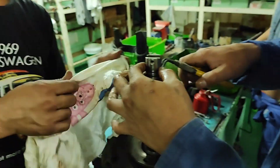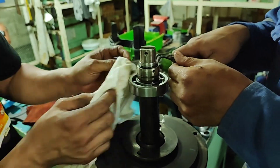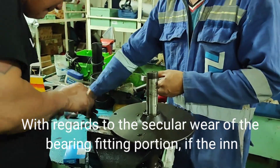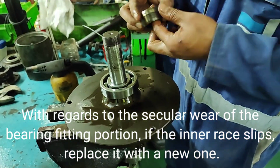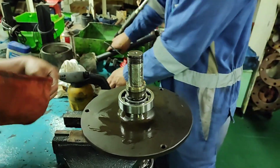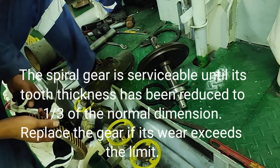Install the retaining ring C. Install the ball bearing 602 on the friction pulley side with the bearing numbers facing outwards. Install the collar 1. Replace with new spare parts the oil seals of bearing housing 3 and 4.